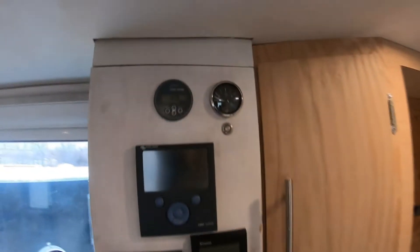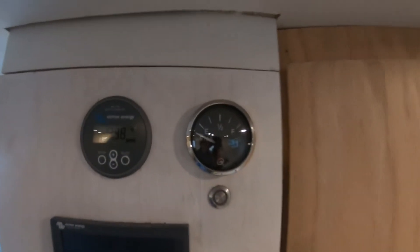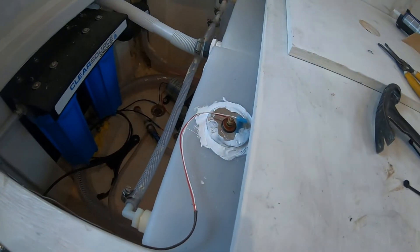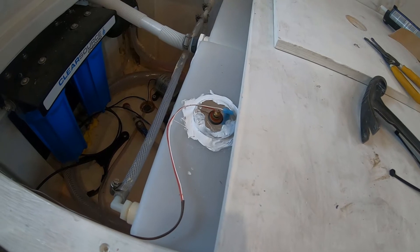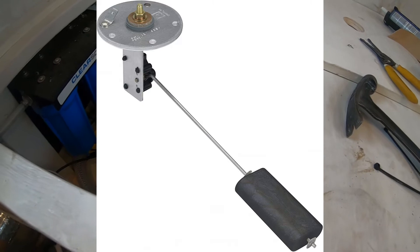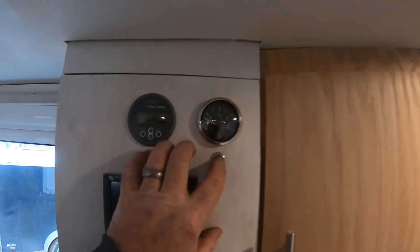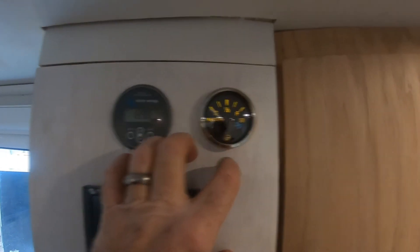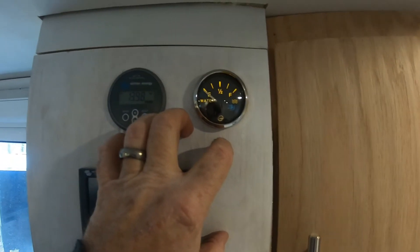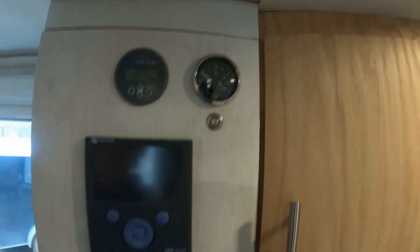I managed to get the water level valve wired up. There's a wire powered behind here, and a wire that comes down to the sensor right there that I put in. This is just a float sensor — I'll put a link to it in the description. I tested it before I put it in and just Sikaflex'd it in. When you hit the button, it turns on the light in the gauge and powers the sensor. You can see it's empty now because I've got no water in it, but I tested it before I mounted it and it worked great, full to empty.